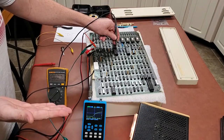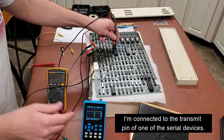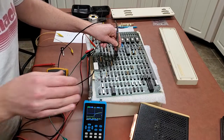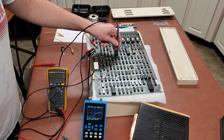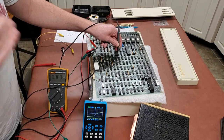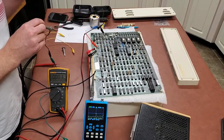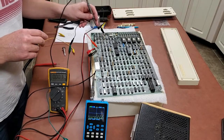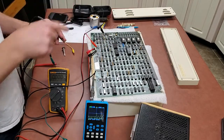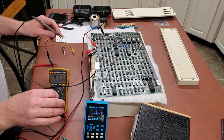It should pull up to 12 volts when idle, and there's definitely some data there — that's a good sign. Let's look at it on this other chip, which is an identical device. Nothing there — okay, so that's for something else. I'm guessing that's for the monitor, and maybe this one is for the keyboard. We need to figure out where that data is coming out so we can trace it to the IO port and actually hook the computer to it. This is going to be a little bit difficult.